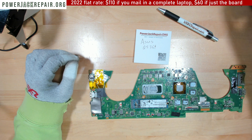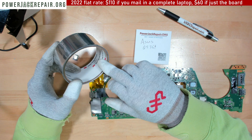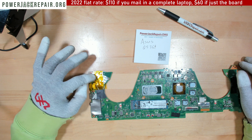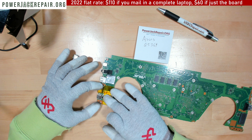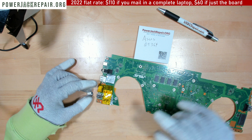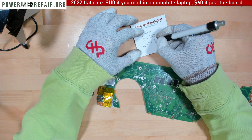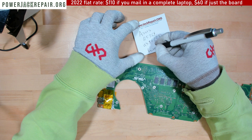As you can see, it's all insulated right here. I insulated it with Kapton tape — the link is below for the Kapton tape you can get from Amazon. I also insulated with the 3M; this is a really expensive product so you don't really have to buy it. I do it because I don't want to spend half a day fixing components that might fall off the motherboard. I insulated the area around the connector so capacitors and diodes won't fall off while I'm working. The board says UX562FD, UX562 Revision 2.